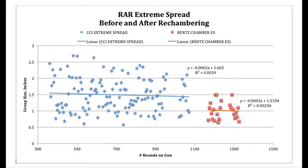Let me swap out and throw another chart up there for you. This one may look familiar if you watched the previous video. All the data on the left two-thirds of the chart are the individual extreme spread groups from the 700-round test that I fired, all with CCI Minimag. The data on the right side in the gold squares is twenty-four rounds of CCI Minimag — the same ammo, fired at the same range, out of the same rifle — but before and after having re-chambered that barrel. It doesn't require a lot of in-depth statistical analysis to say it looks like two completely different sets of data, like it was fired out of two different rifles. That's what a tighter chamber will do for you.